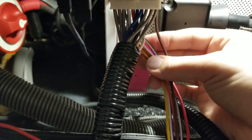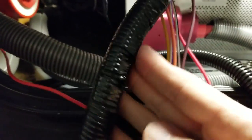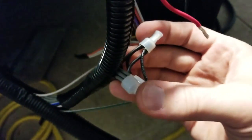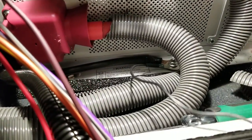Here's the wiring harness that plugs into the AGS. I separated out the wires that I used and the wires that I didn't use. Basically you connect pretty much all the grays and all the blacks to ground, which I've got grounded right there.